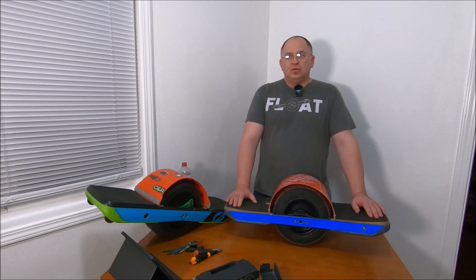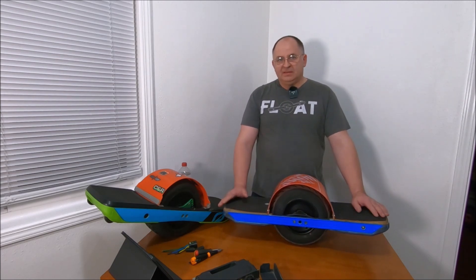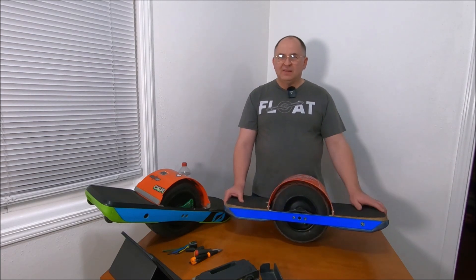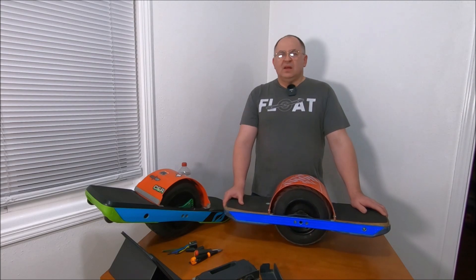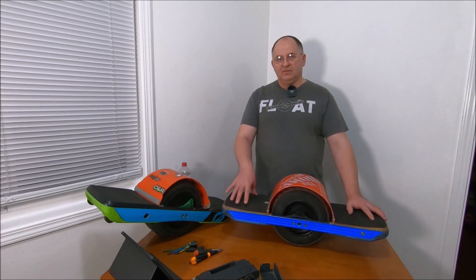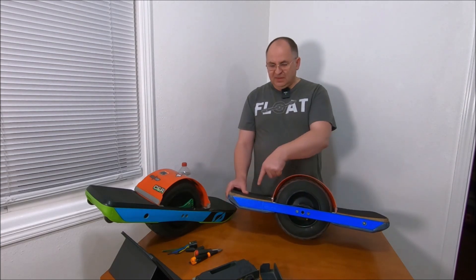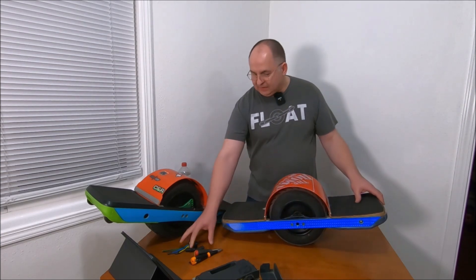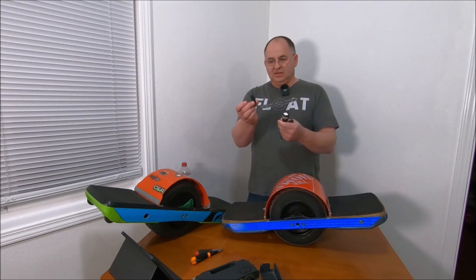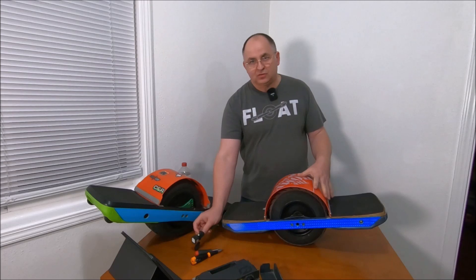Since we posted the last video on YouTube and in Facebook groups, we got so many questions. People are wondering how I built it, how much it costs, and pretty much what parts I modified. To be honest, I can tell you upfront that to do that build, you modify pretty much everything besides the rear footpad. The rear footpad is still the same, but the rails are modded, motor harness modded, main harness modded, all connectors — the footpad connector, motor connector, wheel sensor connector — you can't use them because there's simply not much room.